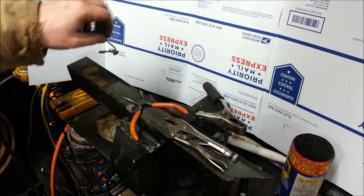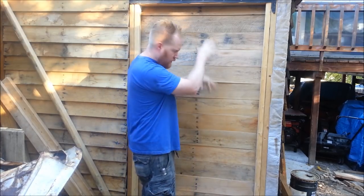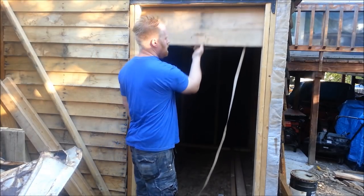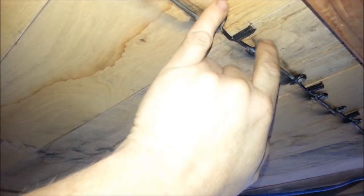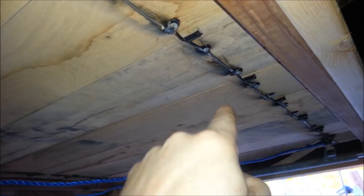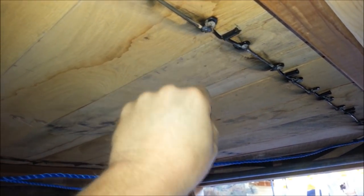A lot more hinges to make. All the hinges are connected, so all these panels are connected together. You've got all the hinges — those are screwed on — but I also welded a nail in between all of them so it's actually one continuous long chain. From top to bottom they all pull on each other instead of each individual hinge bearing the weight — otherwise the top hinge would bear the weight of all the bottom ones.